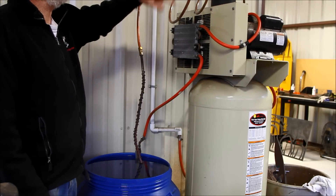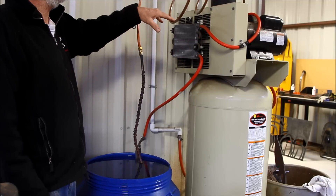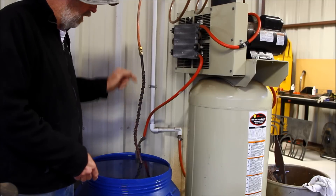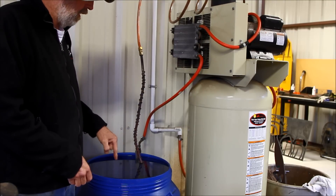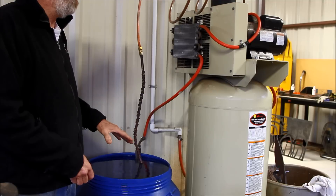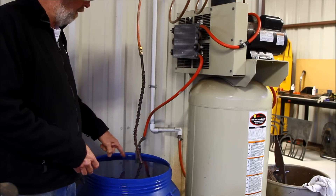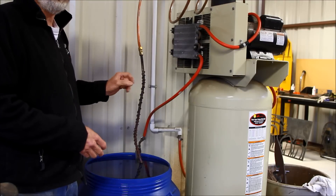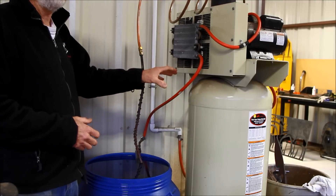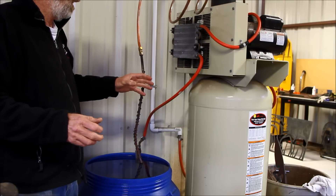In the other part of the video, the air is running through this copper tubing, cooling off a little bit just through the air. But then I have a coil of copper tubing running into 50 gallons of water. The water is 50 degrees right now, so it cools that air off. By the time it gets back out, it's cooled almost to 50 degrees again. So the air going into your tank is at the same temperature as outside and it doesn't sweat.